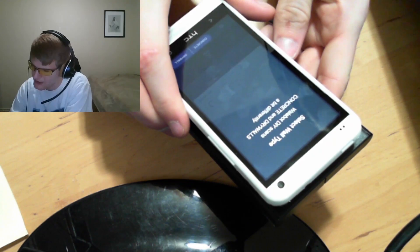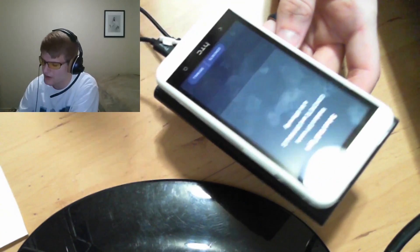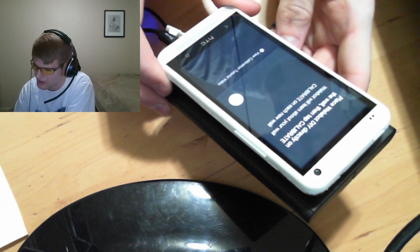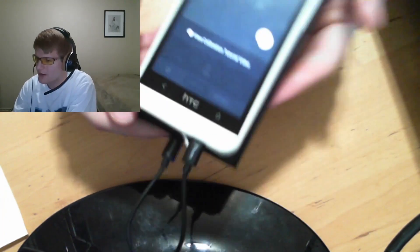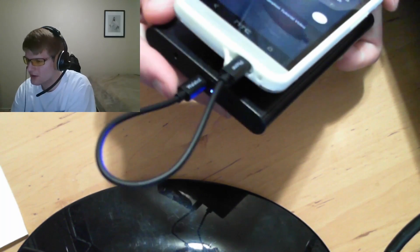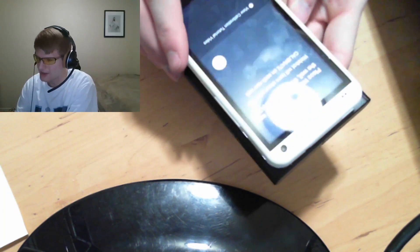It shows Wallabot DIY connected and asks us to select wall type — Wallabot DIY scans concrete and drywall a bit differently, and we are going to be scanning drywall today, so we select drywall. Place the Wallabot DIY directly on the wall then tap calibrate — Wallabot will learn about your wall, and you should calibrate on each new wall. One quick note: on the actual cable itself there are the words 'phone' and 'Wallabot' — you need to make sure you're plugging each end into the correct device. I had a little trouble with that and was receiving an error until I realized the ends are specific.